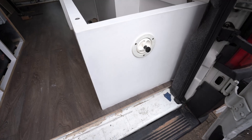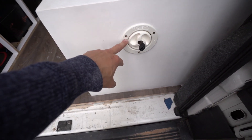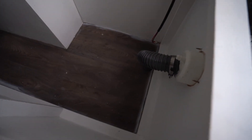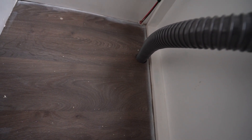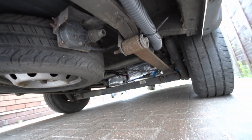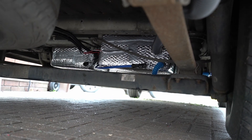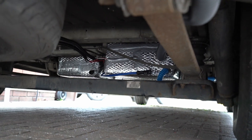To install the tanks last week, the next thing we need to do is be able to add water to the tank. I installed the fresh water inlet in the back of this bench and it just goes through here, through a pipe through the floor back outside, which comes through in between here — you can see the rear tire is there and that's where the hole is. It just feeds through, cable tied, and goes all the way to the back of the tank, clipped on with those little clips that came with the tank kit, so now we can fill up with water.